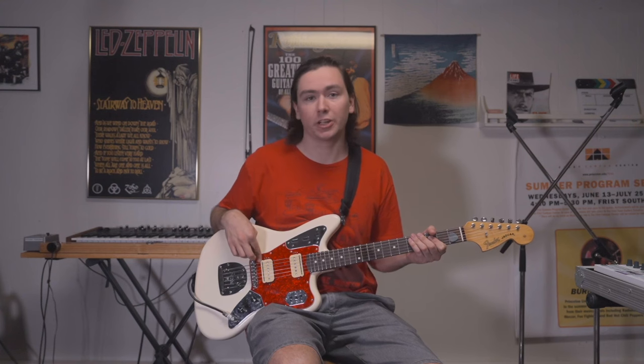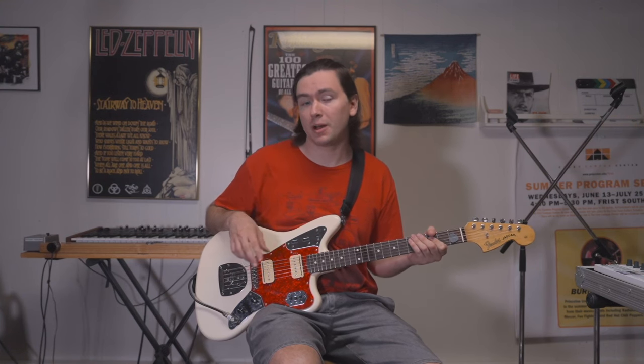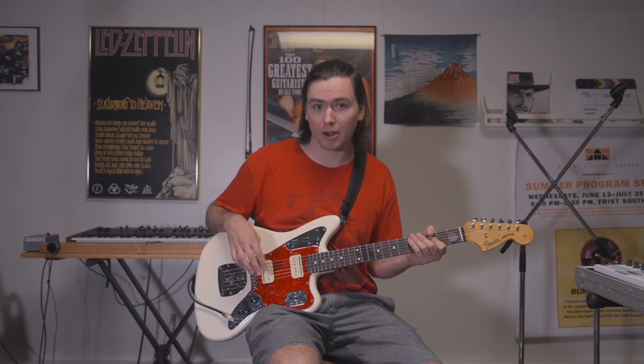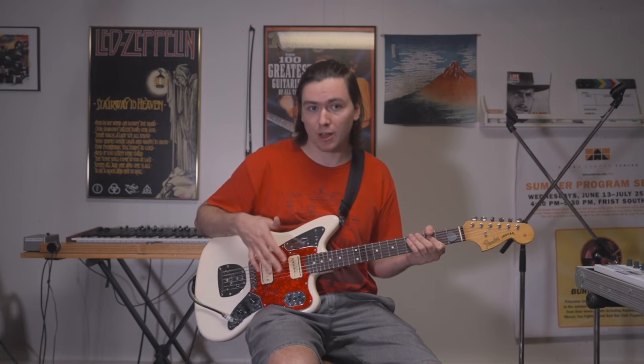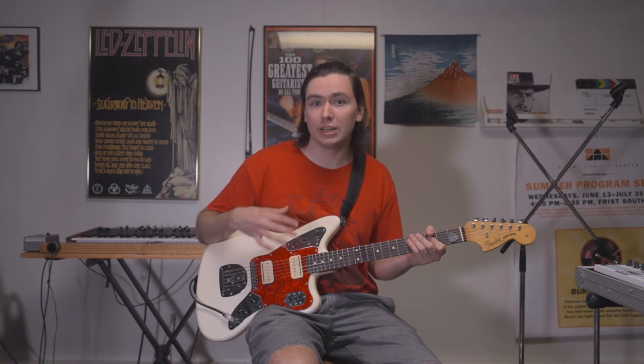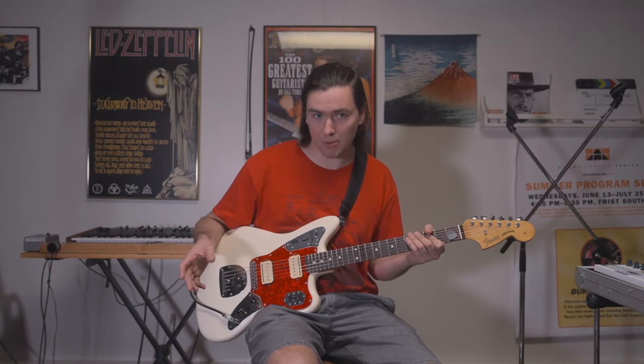More recently, I had heard about the P-Rail pickup, which pairs a P90-style single coil with one of Duncan's Rail-style coils. Viewers of the channel may remember that I briefly experimented with their Hot Rails mini humbucker in my Tele before giving it a full lace sensor treatment like Johnny's. The cool thing about P-Rails, though, is that with the right wiring setup, you can use them as a full humbucker with both coils in series, or access either side of the pickup independently or in parallel. This gives you a really wide range of possible sounds, from brighter to darker, and a range of output levels.